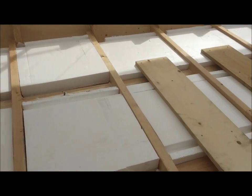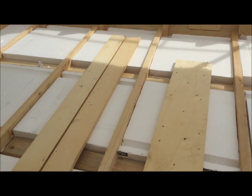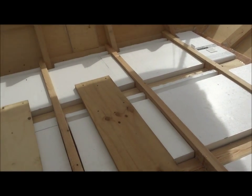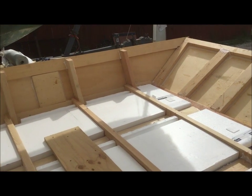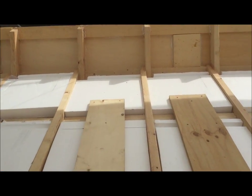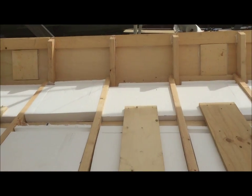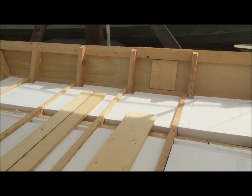Down the center of the boat here where the main walkway is gonna be inside the blind, I am laying a couple of scrap three-quarter inch boards in. I'll eventually put some adhesive on them and glue them into place after I figure out the floor cutting. So I'm gonna get the floor laid in, cut out, situated where it's gonna go, and I'll take the floor back off. Then we will glue these boards down to the styrofoam, put some glue on the top of them, put glue across the frame members, and then glue and screw the floor into place.